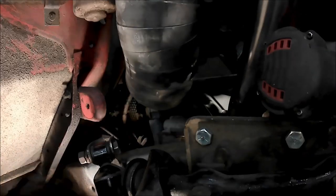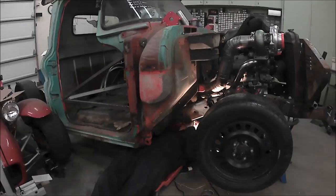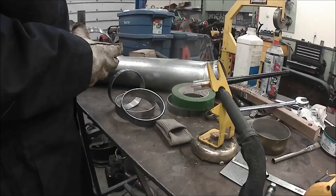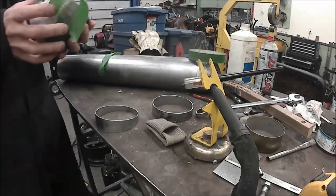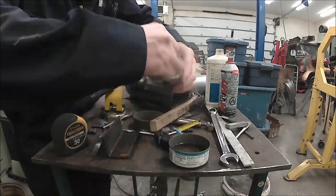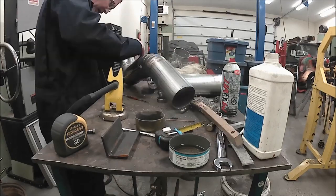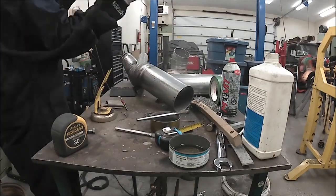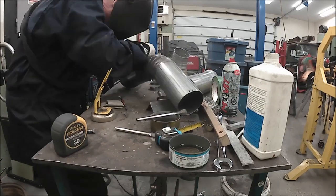Anyways, trimming a bit of the inner fenders to clear everything, getting the exhaust sneaked around. And the nice thing about the pie kits is you can clock the turns to clear things a whole lot better than if you're doing mandrel bent U's. So it's kind of neat. Tedious and time consuming, but they do also kind of look sexy.